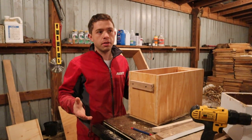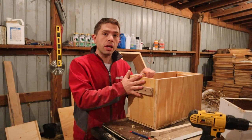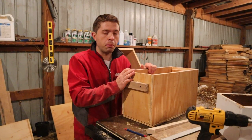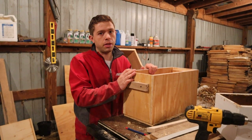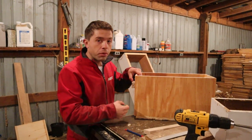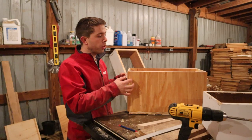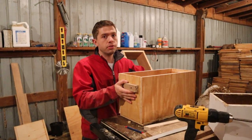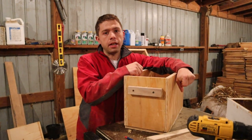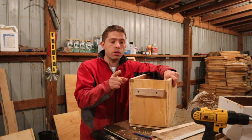We didn't cut it on camera like some people probably wanted, but if I said everything I needed to say and then cut it, we'd have a 30-minute video. They really don't take that long, and once you get one down, the measurements are a piece of cake. With a good table saw you can make a lot of these in one day — just seal them up. Don't forget to assemble them really well: everything is glued and then stapled. If you don't have glue, use screws — you need all the strength you can get. Even if you just have two or three hives, I'd still have a couple of these boxes handy because you never know when your bees are going to swarm.